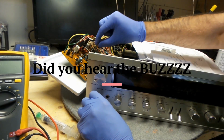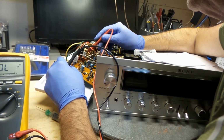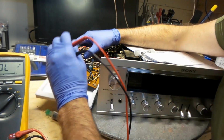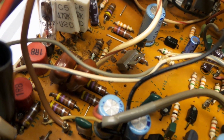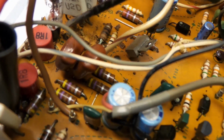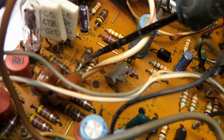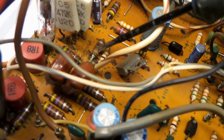So I'm still having an issue. This light is totally cut off. Okay. Look at this. Guys, I gotta show you this. My issue was I wasn't able to set the bias on this channel, and a little bit more investigation was there was a lot of that glue that was set around here, and you can tell how the corrosion was advancing well. Look at this resistor.